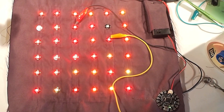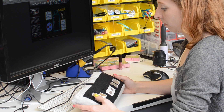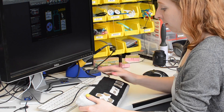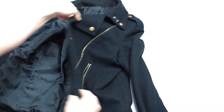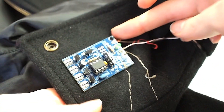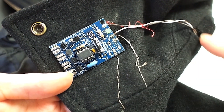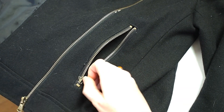Here's where I have to insert a warning about conductive textiles. If you already know how to sew, it can be tempting to use conductive thread as your first foray into electronics, but it's not actually easier than using wire, and it introduces some problems that wire doesn't have. Conductive textiles are novel for certain applications, but they do not replace traditional insulated wiring when it comes to power delivery and signal reliability. For example, I made a zipper switch using conductive thread and a metal zipper pull — as it passes by the two embroidered pads, it closes the circuit between them. I put one of these on my TV-B-Gone Hoodie project, but the rest of the circuit uses traditional insulated wires, tack stitched in place inside the garment.